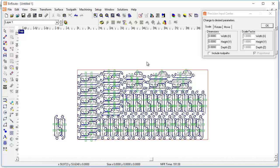So you can get 65 parts on here and align them so the bridges don't cut out, with a little bit of extra work. It took about 17 minutes to go through this demo. It'll probably be worth it in the long run to spend that little extra time to get that kind of a result. But again, it'll be a case-by-case basis as to whether there's some kind of technique you can come up with. Having these long edges and parts that fit together helped a lot — this would be a good one to cut.